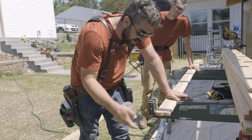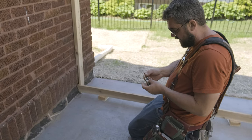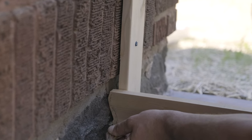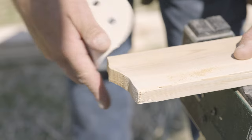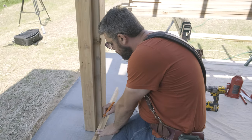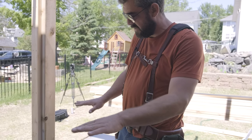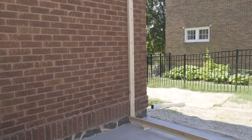I made the cut — the jigsaw left me with a little bit of a ragged edge, so I'm going to grab a piece of sandpaper to clean it up. I'm not quite happy with that yet, so I'm going to scribe it again. Sometimes you just have to do it a couple times, make another cut and polish it up a little bit. That's a little closer to what we're looking for, so now I can go ahead and mark the end and make our first length cut. We're happy with that fit, so we'll go ahead and put a couple screws in each end and start using our spacer blocks. We'll scribe the next couple boards until we get to the flat part of the wall over here, and then we'll just have length cuts for the rest of the way.